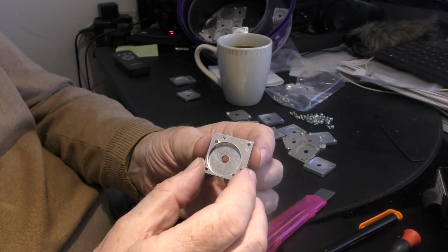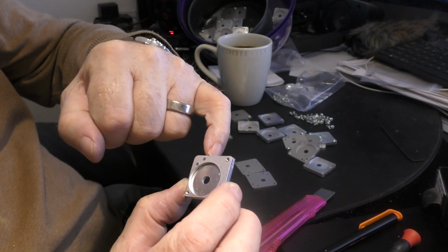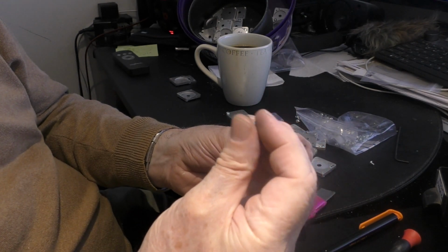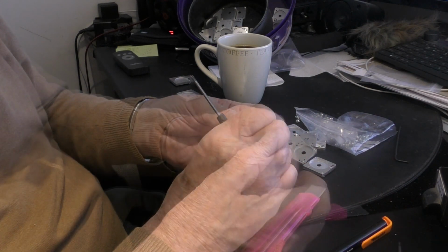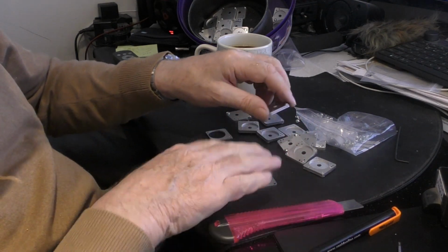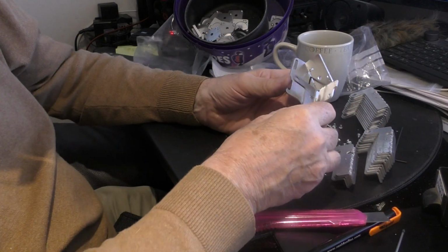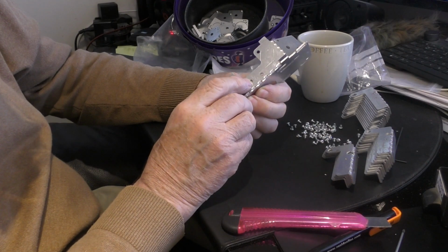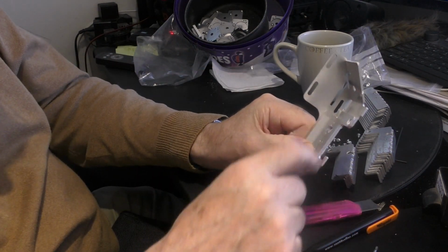To make sure these pieces go together the right way round, on the drawing, I'm going to modify the drawing, so just here I'm going to put a little notch, and here I've got an M3 by 4mm long posi panhead screw. Now it must be 4mm long. The screws do not come through the front there, and that's quite an essential part because I need that to sit on a flat surface so that I can tap the corner holes. The liner fits inside there, and this hole on the end here, the slightly slotted hole, takes an M3 screw and holds the liner into here.